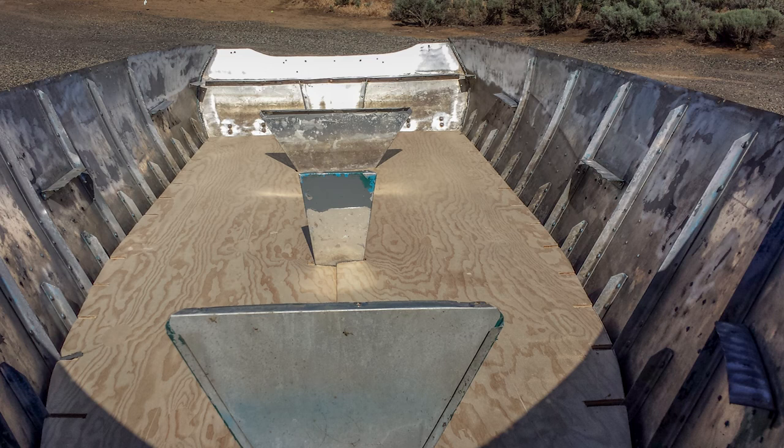There are three vertical metal risers welded into the bottom of the boat, and those are the only vertical supports that will hold enough weight for the benches without bowing badly in the middle. On the side walls, there are L-bracket plates riveted in — the two L-brackets on each side support the ends of the boards, while the center of the benches are supported by those vertical risers. So I had to meet those positions, but I changed the shape, width, and placement of the benches as best I could to get them where I wanted.